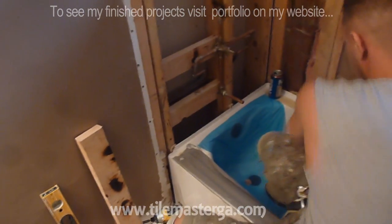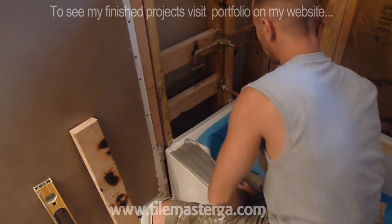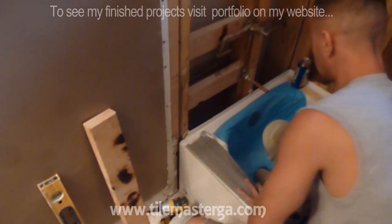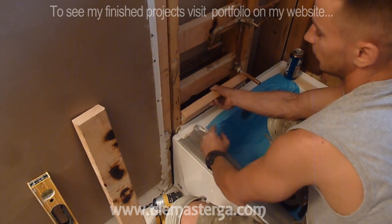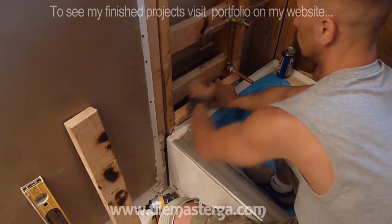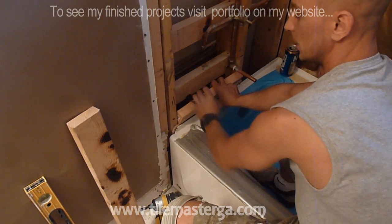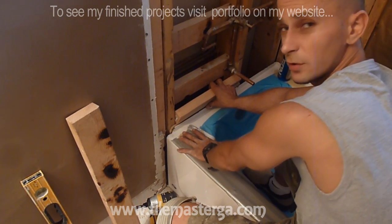Alright, another important thing will be blocks. I don't know if you've seen my video about installing the board in a shower, but if not, it's something I would recommend you also take a look at, because there's lots of important and good information. But for the walk-in shower, what we always do on the bottom part, we install blocks in order for the bottom piece to not have any movement between the studs. There's a 14 and a half inch gap, so if we put the tile board and even tiles, if we put pressure, there will be movement, and it causes grout to crack and eventually some other issues to happen.